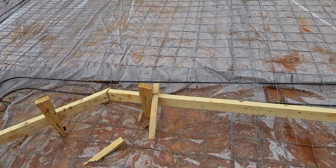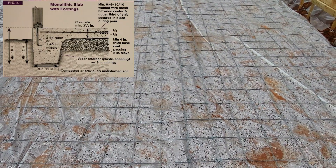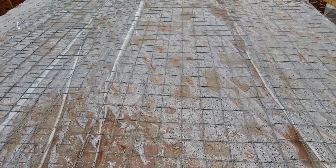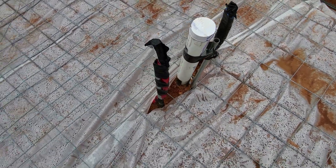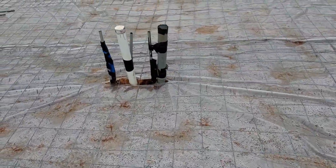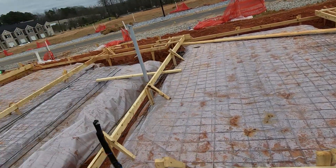In this particular case, I'm going to have to check the soil reports on that. He didn't elevate the wire mesh — he should have elevated the wire mesh. And he didn't seal around the penetrations. These plumbing and wiring penetrations — you've got to get your tape and seal around all of those. All these penetrations are required to be sealed. You've got to go back and seal those up. But this is what it looks like right before the concrete comes and gets poured.